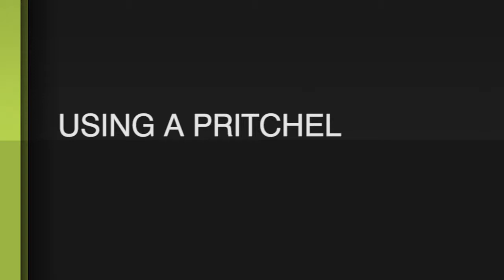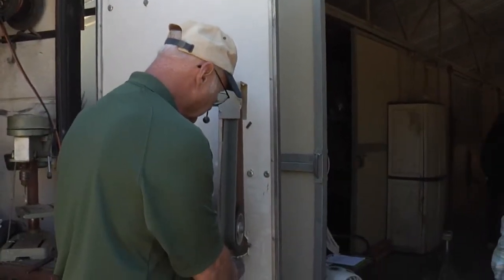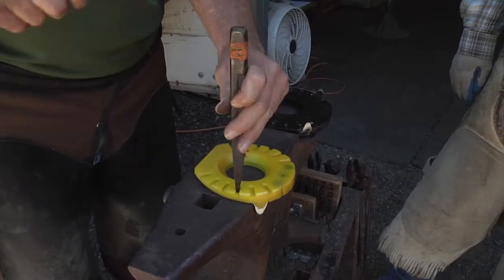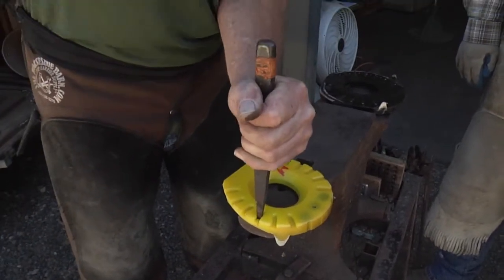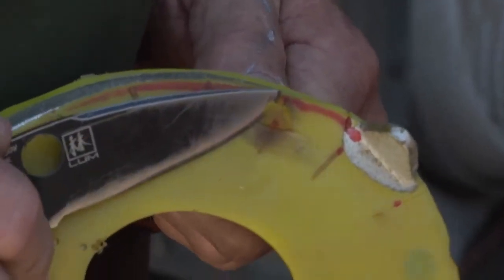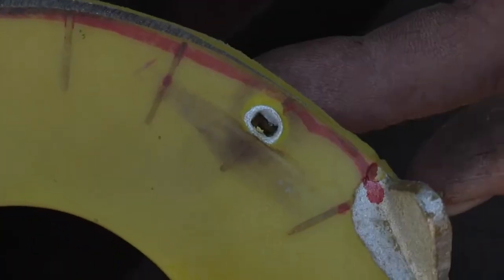In case you lose your drill or it breaks or dies, and you need to get holes into your shoes, you can still put them in with your regular traditional farrier tools — a good sharp pritchel. The end needs to be sharp and flat on the bottom. You have to pritchel it from the ground surface, which is different, so you don't have quite the accuracy. You place it where you want it, drive it in — now it's contacted the aluminum. This is the way the French pritchel all their shoes. A piece of aluminum is driven out through the shoe and there's your nail hole. Very easy.